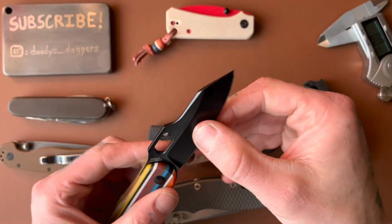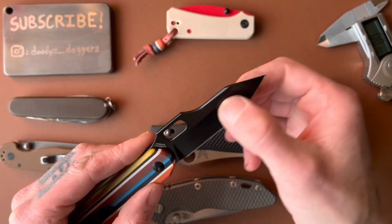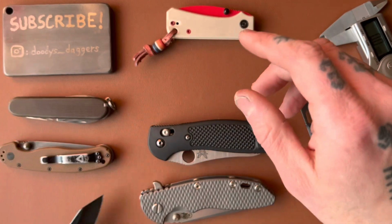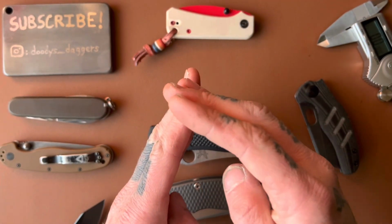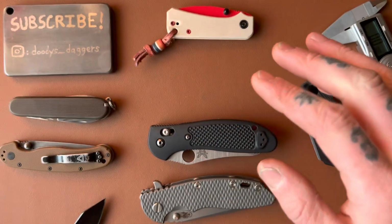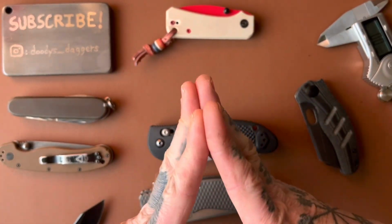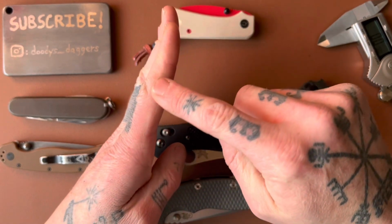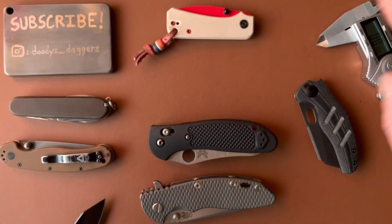And then we have hollow grinds, which basically, as you sharpen the knife, it's not going to widen out as quickly. With a flat grind, if you're looking at it from above, it's basically like this. So as you sharpen the material away, it's going to get thicker and thicker as you travel up. So the thickness behind the edge will change as you sharpen it. The hollow grind is more kind of like this. So as you sharpen it, it very, very gradually gets thicker as you sharpen the material away.